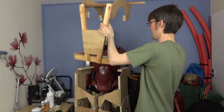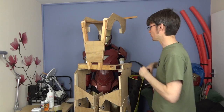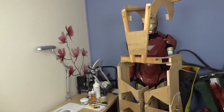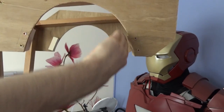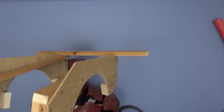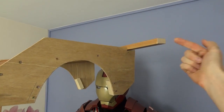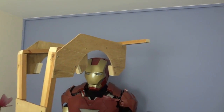So this is what I've eventually made, which goes on there quite nicely. As I said, all the joints are going to lock. I haven't done the actual top of the thigh joint yet, so I'm just clipping these on with a couple of clips so they don't fall off. We've got some shoulder scoops there — we need to put some pads in; there's going to be a flat piece of sheet material and then foam on the inside for each shoulder. The big stick at the top is about just over six feet high from the ground, and that's where the arms are supported — the shoulder bell of the actual suit is going to be much higher so it can pivot around on a gimbal.